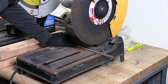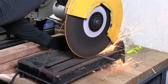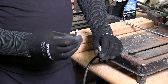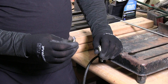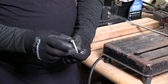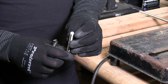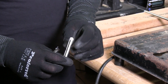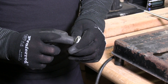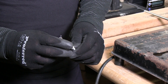With the carbide saw you didn't see any sparks, but with this abrasive saw you're going to see a lot of sparks. This is the threaded rod I cut on the abrasive, and you can see the residue left over from the cut. Not only that, but this gets very hot when using the abrasive cutter. This is what's left over from using the carbide blade — there's a little bit left over but not much. Depending on the size of the product and the material you're cutting, you'll have less burring.